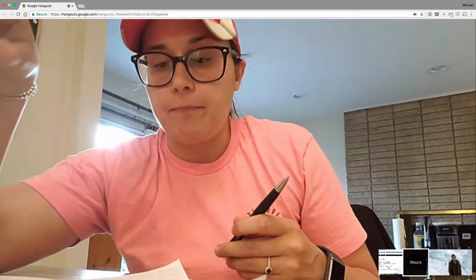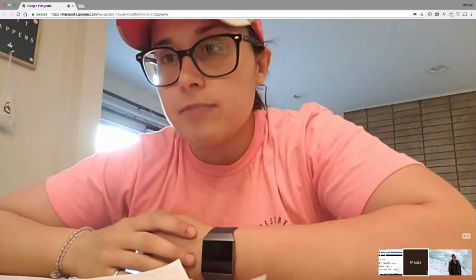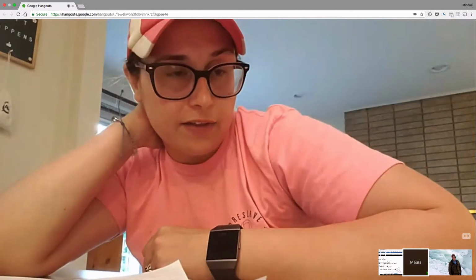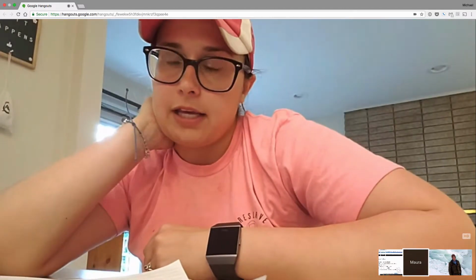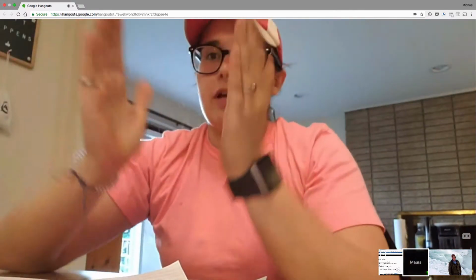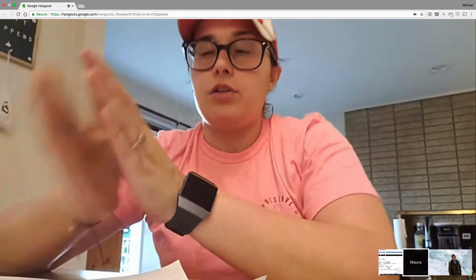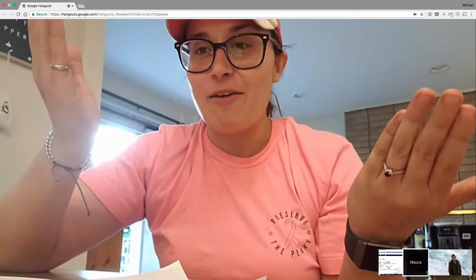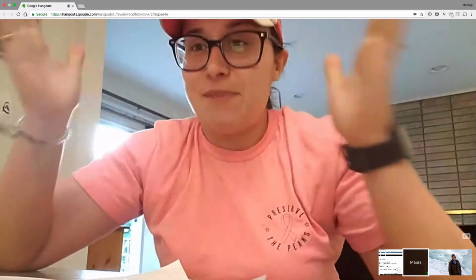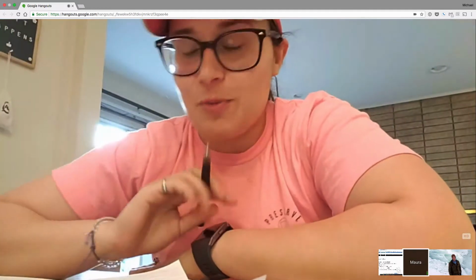When you design your upright, be sure that you're completely understanding the steering geometry because that's a huge part of the upright. Where does it need to be on the upright? Does it fit within the rim, etc.? And make sure that they're mirrored images of each other. So when you send it to the CNC, don't ask for a quantity of 2. You're going to have to mirror that one because we did that our first year and we ran into huge issues. Oh, wow. They should be mirrored images of each other. Right. So we're too wide.